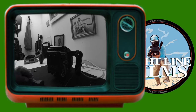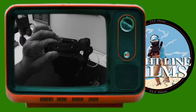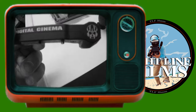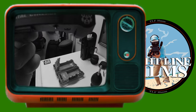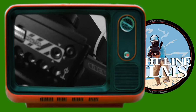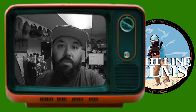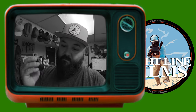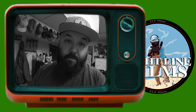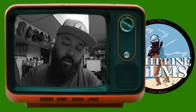There are two screws that screw down — one right there and one there. As you can clearly see, there's no way that's a deep enough thread — there are half a dozen or more threads down there. You need to use most of them, and this is a product that is taken on and off the camera — not super frequently but frequently enough. You cannot have only three threads engaging; it's going to strip, especially if you have a hard helicoil on the camera and a soft screw.